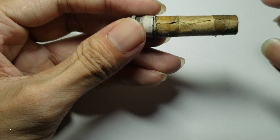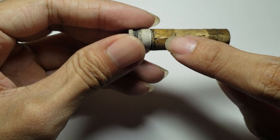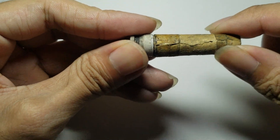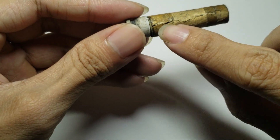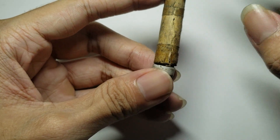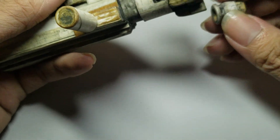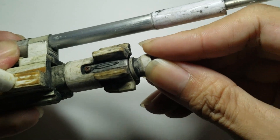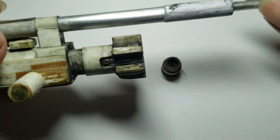My theory was that I was using a large amount of fast burning powder as a booster, and that's probably what caused it — because it's near the base and there's a large amount there. It basically just cracked here first and then moved outward. That's why the base was stuck in the bolt. I'm not sure why I didn't extract it out, but that's not a problem.